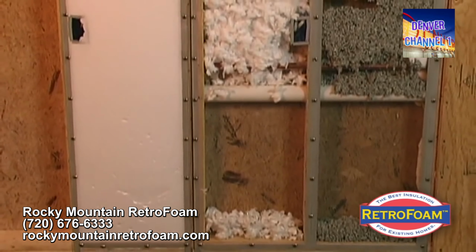We have a system here where we have some different types of insulation. This is fiberglass batting insulation. This is usually in the walls of the home, but it doesn't stop airflow, and that's what this is trying to show. So now what you're seeing is that you're seeing this ball move because all of that air is coming up through this and still getting through. This air will come into your home, and that is what you're trying to heat or cool. With this, as you can see, there is no movement. It has eliminated these drafts that are in your walls that make it uncomfortable and make it to where you have to continue to put heat or cold in your home.